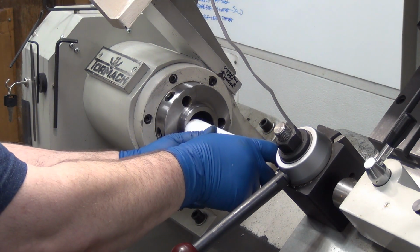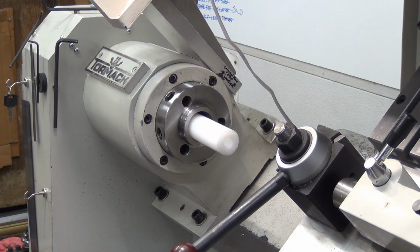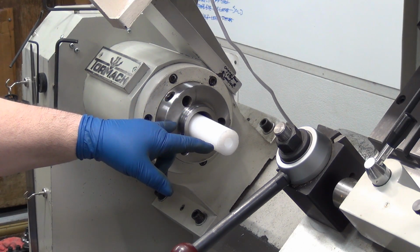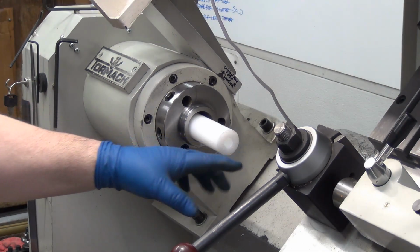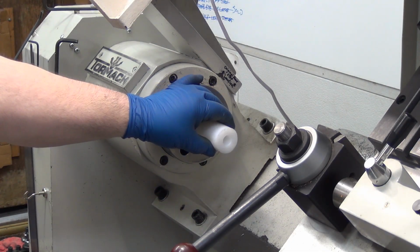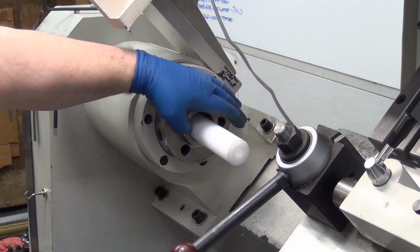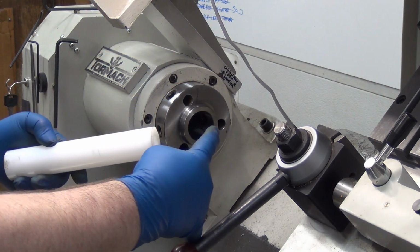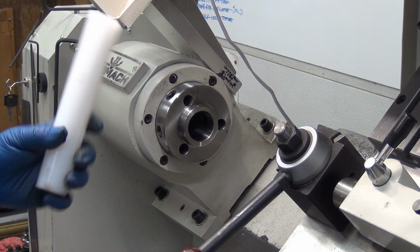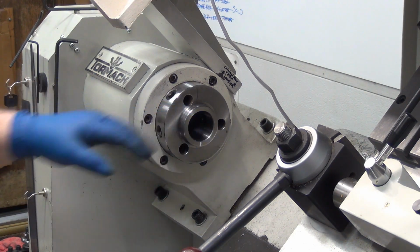But considering from there, I'm actually getting a lot more stock there inside. And that's about the thickness of the chuck. So I could still add another 3 inches out here, 2 inches, whatever. I'll put the chuck back on and I'll do this again. And then I'll be able to just pull it out a little bit, run it through a cycle, pull it out a little more, run it through a cycle, pull it out a little more, and I'll be able to process a longer piece more consistently. So I think it's going to be worthwhile having pulled that out.